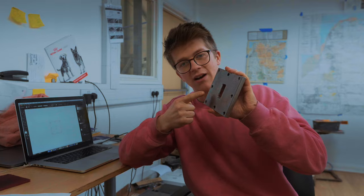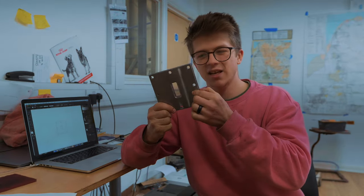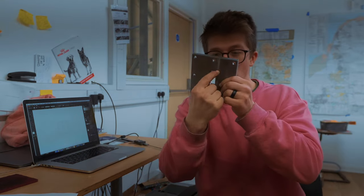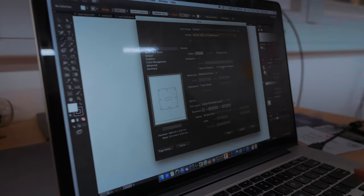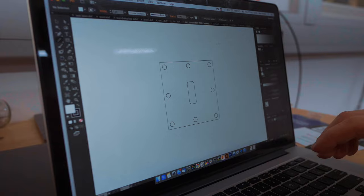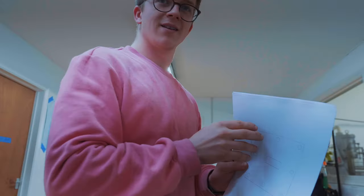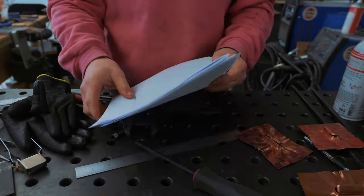Now, milling this stuff took forever, but I could actually get laser cut 10 millimeter or 3/8 inch thick steel with different hole sizes, and then all I would have to do is put the little inside corner radius on. So while we might not have a laser cutter, we have a laser jet printer. We've printed off all the different sizes that we've got.